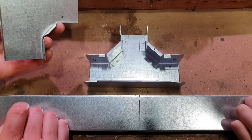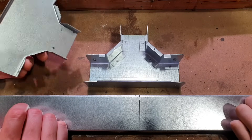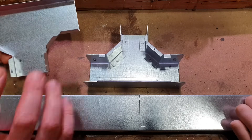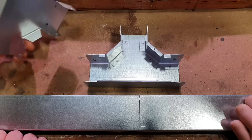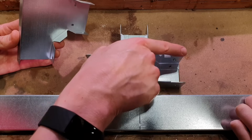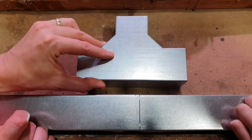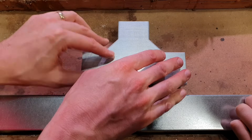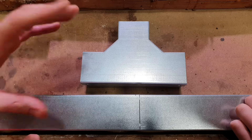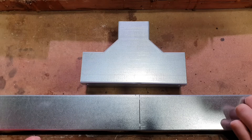It's really interesting to note that if you look at the lid here, you can see there's no fixing — no turn buckles, no screws. In order to hold this on, once you've got your trunking installed, the lid will slide up to a point and then when you clip that on, it actually clips over the trunking lid, and that's what holds it in place. So it's just sprung in place. We're going to look in future videos at exactly how we connect this together, so watch out for that.